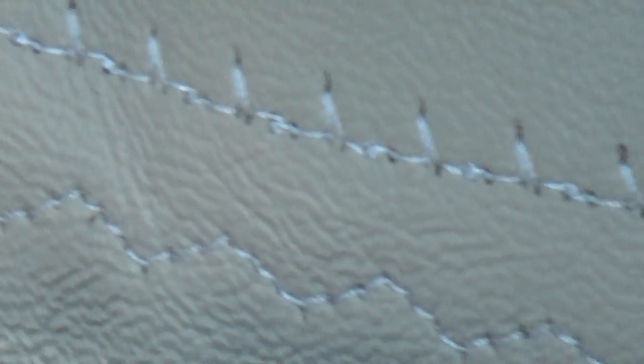So, all right, let's take a look at these. And I actually have it upside down, don't I? Because that top stitch is the comb stitch that we did second, but just reverse it in your mind. So the bottom row we did first, we'll go down both of them, look at them at the same time, is the 3-point stitch. Top row is the comb stitch. And the stitch spacing, the formation is just absolutely spot on.